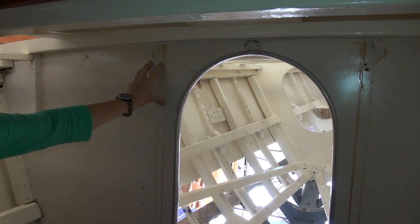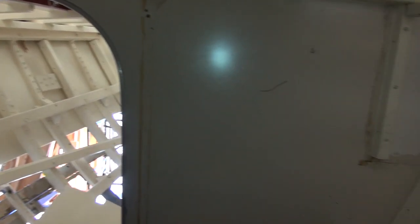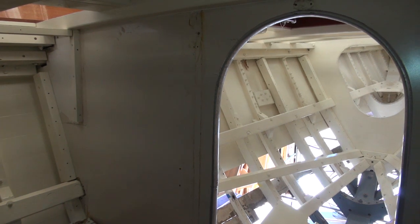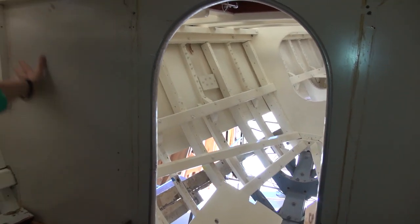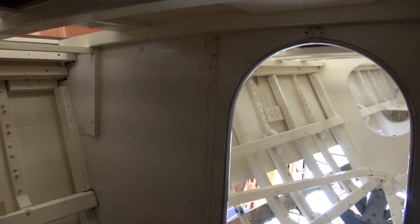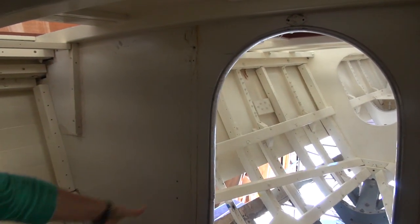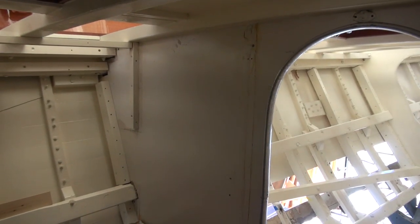Can we clean this up to see how clean we can get it before we decide to fill in or paint it? It would take a week or two to replace this bulkhead. What were we planning? Just cleaning it up. There's going to be a door there, but you see all this — you can take some of that off with acetone, razor blade, and so forth. But sooner or later you have to fill those holes with something close to the same color. If you use that marine-grade paint on the back there it would clean up real nice, but paint and formica don't get along, even if you prime it heavily — or scratch it really good with 80-grit.